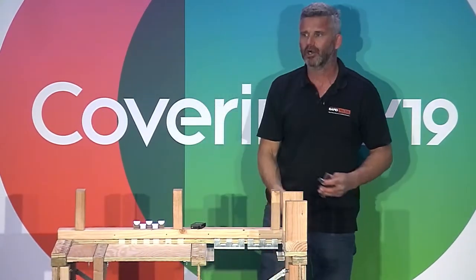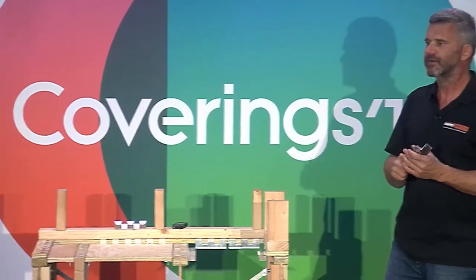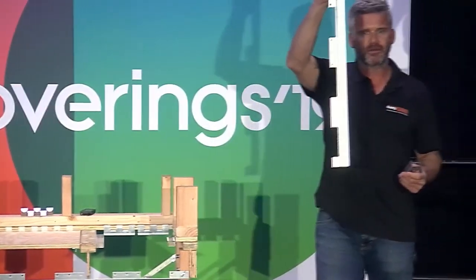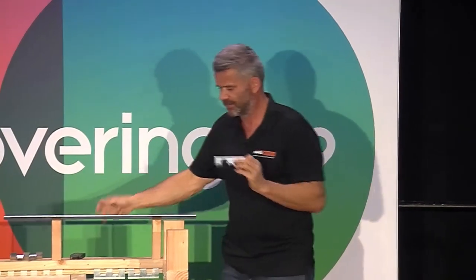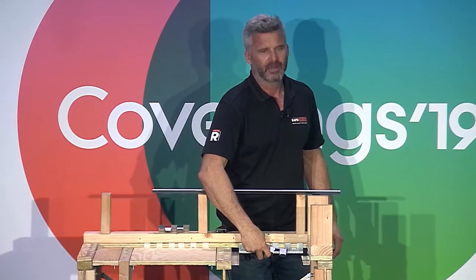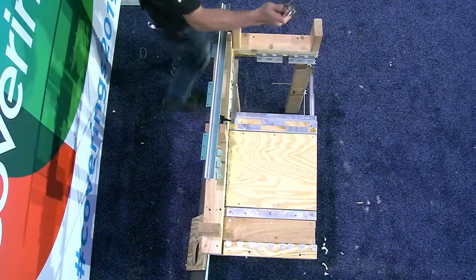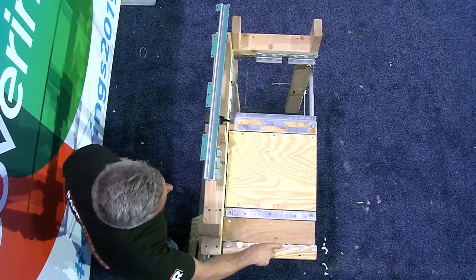So 25 square feet in a box, worst case scenario — meaning you have an extra joist, they're too close together, running the wrong way, or cross-running. The brackets are five inches and four foot lengths. For perimeter at the framing, one per bay — because you'll have 12 and a half inches left. When running them at the entry to the shower, two per bay, or two per linear foot, depending on which way the joists go.